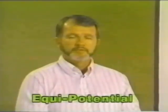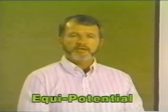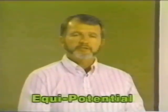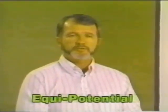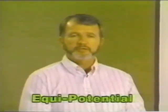I say unfortunate because the use of the word single introduces into the issue numbers, where numbers really don't need to be. There's a term that I like much better, and that term is equipotential grounding. Equipotential is a contraction of two words, equalized potential. And the creating of a zone of equalized potential is the single most critical element to be considered in any grounding program.